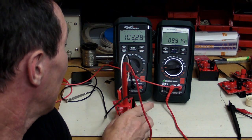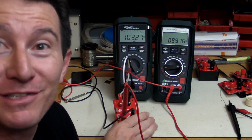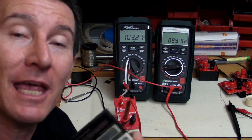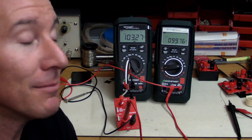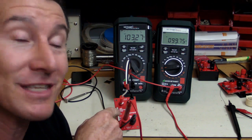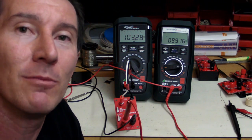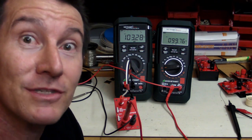Let's investigate a really bad case board — this one's about 3.5% out. Based on these readings, instead of the 10 ohm resistor being 10 ohms, we calculate it should be about 10.35 ohms. Let's actually measure this resistor and see if we get around 10.35, ignoring the other resistors and assuming they're spot on — there will be a bit of play there, but let's measure it and see.